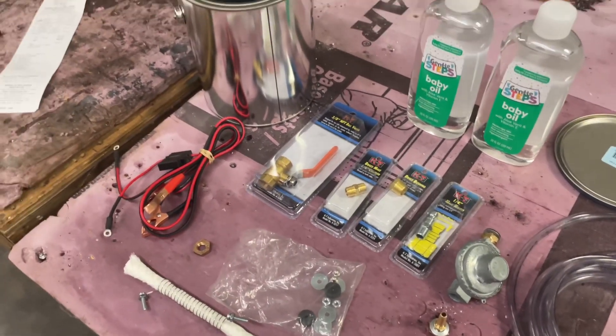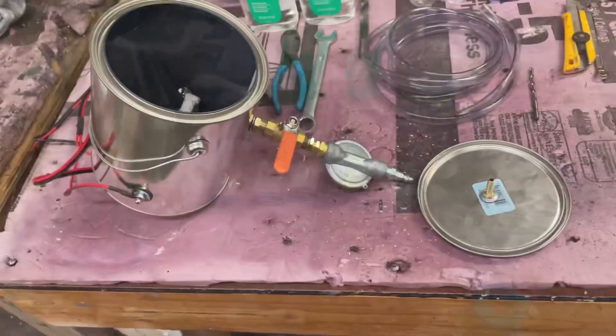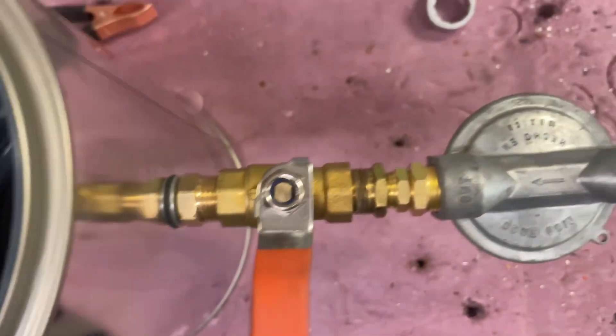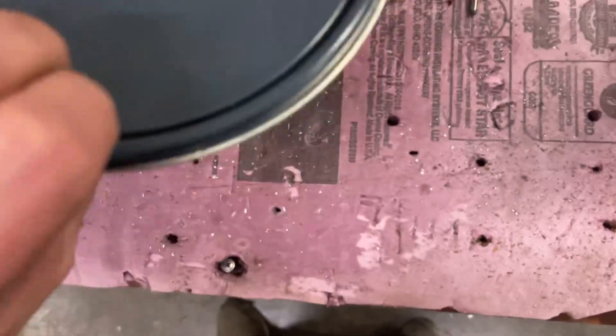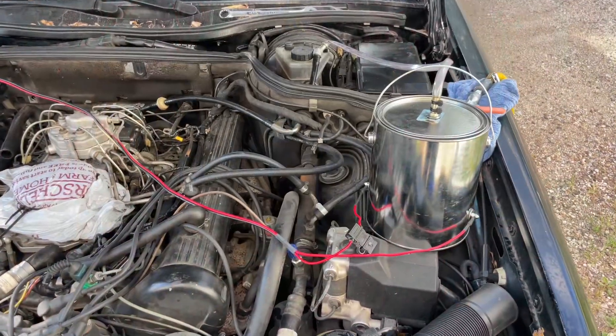I've got the drill here, so we're going to drill some holes into this bucket and get this all situated. Here we've got the wick and heat element placed in — they go all the way down to the bottom. I drilled a half-inch hole for the grommets and a three-eighths hole for the valve fitting. It didn't come out beautiful but it is sealing. The center of gravity has shifted, so I'll need to support the bucket when hooking up the air hose. The output nozzle goes out the top via a three-eighths hole.